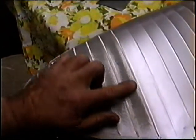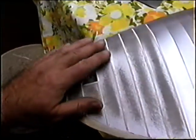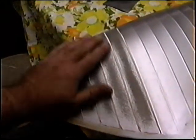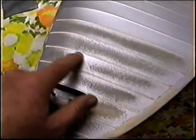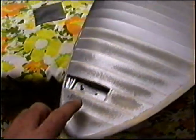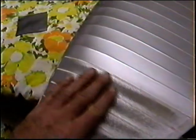When you can see the middle of the bay is just so showing the little flaws that may be there, and just a little bit around the edge of the caps, because that's where you want to have some extra material, and everything else pretty much sanded off. Now, just as an example, this bay here, I could sand a little more off as I get fussier and fussier. Right out here, I could take a little more off, even though this is the outboard tip. Weight isn't really a factor out here.